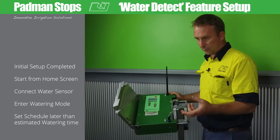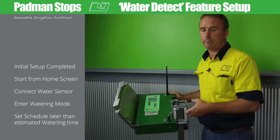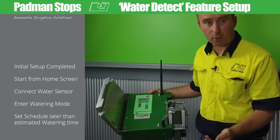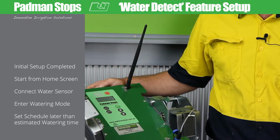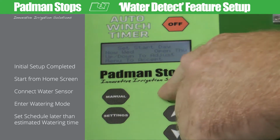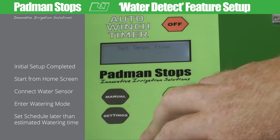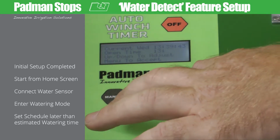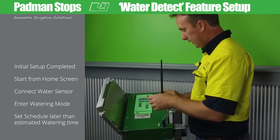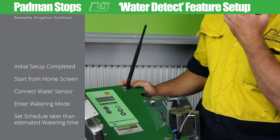However, if the water's going to hit the sensor today, we would set the schedule up for, say, 2 days' time, because the AutoWinch needs to know how long it's got to be open for. If we think the water's going to hit it tonight at 8 o'clock, I will change the day to Thursday, say tomorrow. I'll hit lock in Thursday. I'll set an open time, which isn't really relevant because it's way beyond when we expect the water to hit the water detector. This is a basic mode, so it will close after a duration once it detects the water.